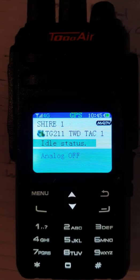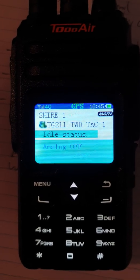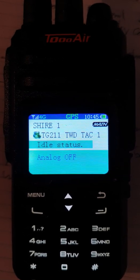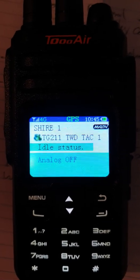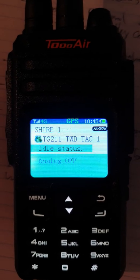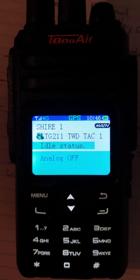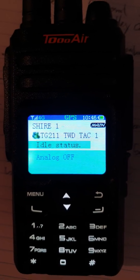It's as simple as it's going to get for government radio network users, and all the emergency services, including SES, will all be on the GRN. I believe Tweed Rescue will as well, for dispatch. But that's dispatch only. You can't have inter-unit chatter on it, except on a simplex frequency or channel, which obviously you've got to be in radio range of that person to hear them. So this is where this type of network comes into its own. You can maintain your unit-wide chatter management, response management and so forth.